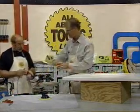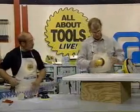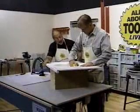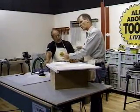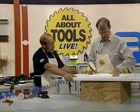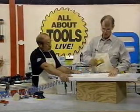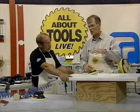One of the real problems that has always existed for every fabricator is when you get into the bowl area, sanding in there. The sander isn't really touching flat — it's riding only on the outer one inch of the pad, and this is a five-inch pad. Even if you switch to a three-inch pad, when you get into a lot of these radiuses, you're typically not going to get 100% contact. Getting down into a bowl on the flat bottom isn't bad, but once you start rolling up into the walls and into the radiuses, you start to have problems.